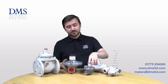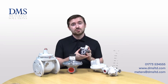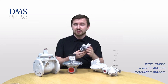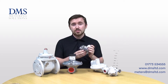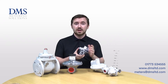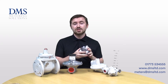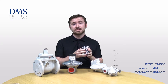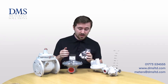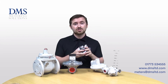A smaller cousin of the J48 is the J78 range. These are available from sizes of half inch up to one inch and have a smaller tolerance of outlet pressures, but there are still variable ranges we can offer. There are two models of the J78: the J78R and the J78RS. One has a blank connection on the vent port and the other, the J78RS, has a screwed connection instead. The vent itself is purely there for the displacement of air in case of the diaphragm moving. The J48 has exactly the same item fitted on itself but there is only one type of connection on the port.